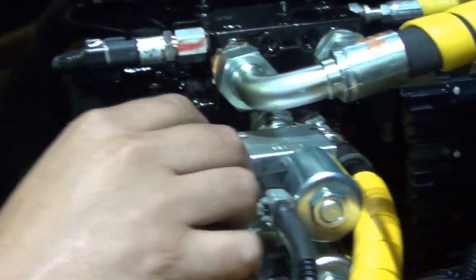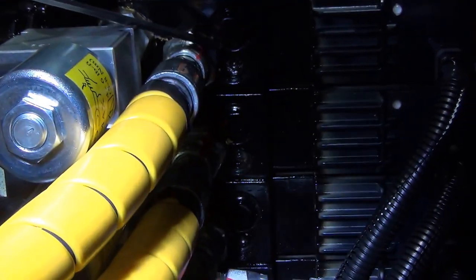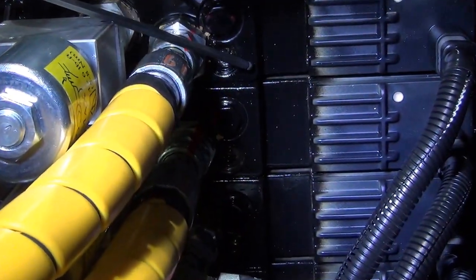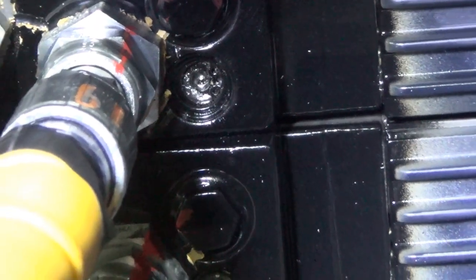You can adjust that right on the left hand side there by turning it in. Likewise, we can adjust the pressures going out on that valve section for our right wing by coming over to the other side, kind of kitty corner — it's actually down there in that corner. And that will adjust our pressures going out.